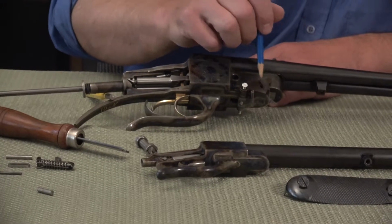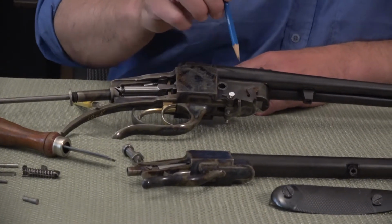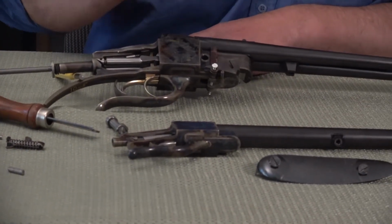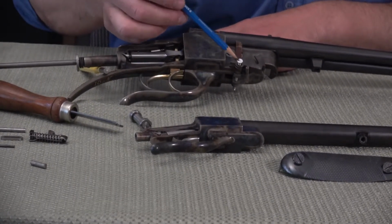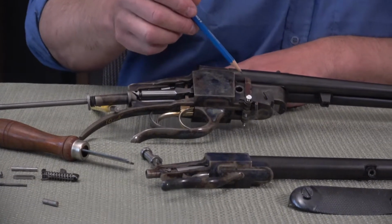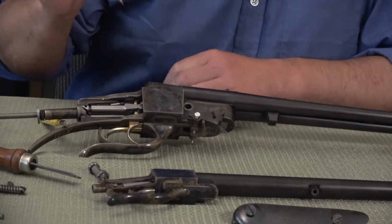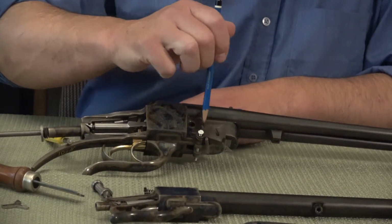Anyway, these two pieces comprise the extractor and ejector, actually just the ejector. In order to eject something, you have to hit it with some kind of force, essentially a hammer, and this is the hammer right here. Now these two pieces actually go into the action underneath. So I took them out to show you how they work, because once I put them in, you won't be able to see them. Now this is spring tension. This thing here I just put to hold the essentially split hammer housing. So this falls back, and there are some other components. This is the spring that drives this hammer, and I'm going to show you the hammer in a second.